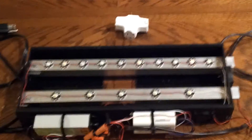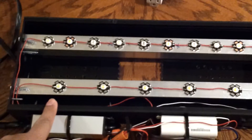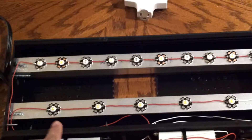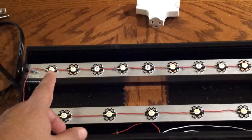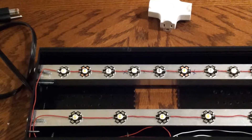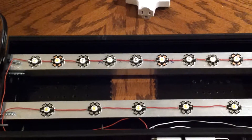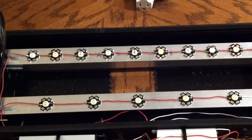I'll start out with the lights first. I've got two rows. My back row is the base light to illuminate the back of the tank and bring light forward — it has 6500K 5-watt LED lights. They're actually pretty bright. The front row mixes the light together. I mimicked it off of the Finnex Fugeray Plant+ — I've got a mixture of 6500K lights, 3500K warm lights, two royal blue lights, and one red LED around 630 or 640 nanometers.